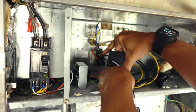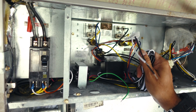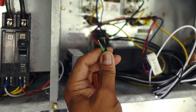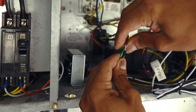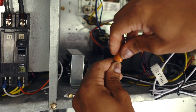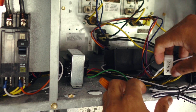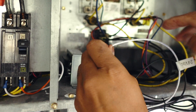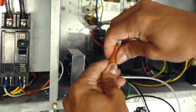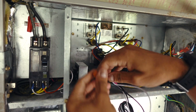Find a location inside your panel where you can secure the adapter and have it out of the way. Once you have your terminals, connect them with wire nuts — take the wires from your adapter and connect to one of the 24-volt wires, get it nice and secure, then repeat the process on the other wire. Give your wires a nice tug to make sure they're connected.